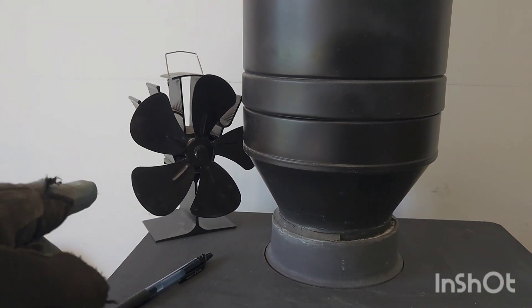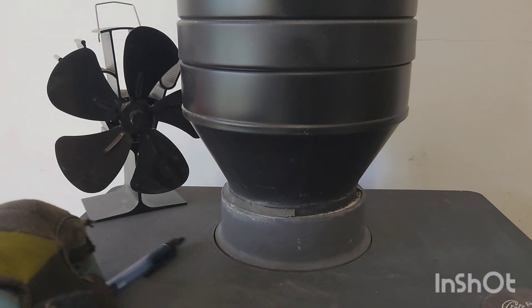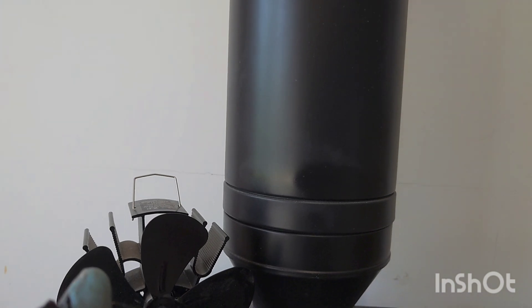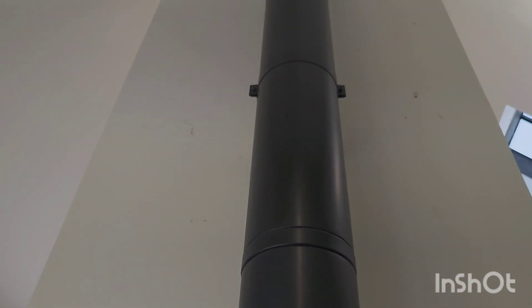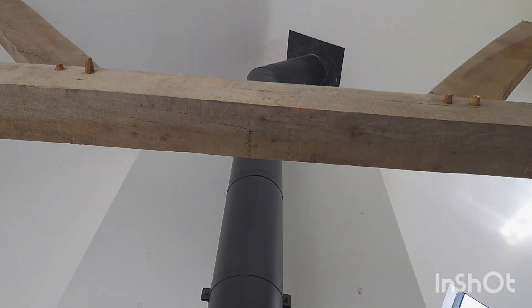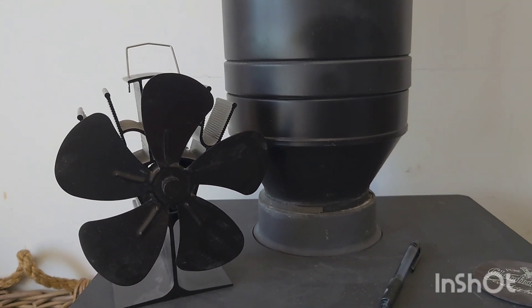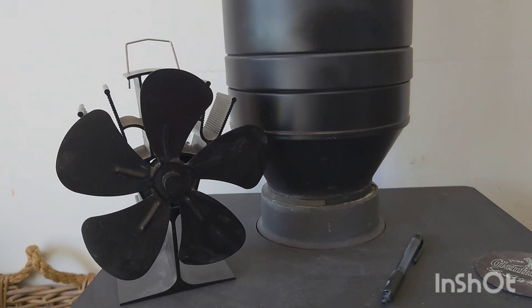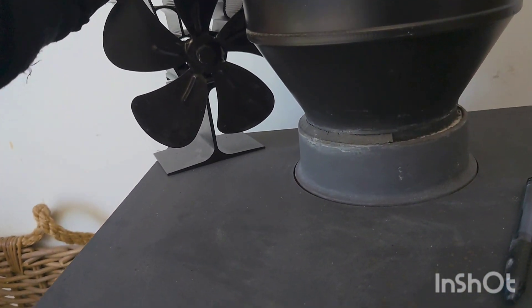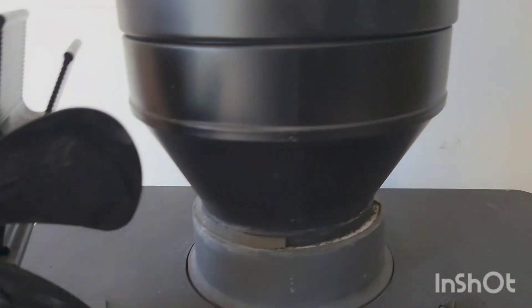This is the appliance I've just done. I've moved the fan and put it at the back. On this one I'm going to leave it as it was — it's the customer's choice. Ideally they should have a single wall flue pipe going all the way up, which would really kick out the heat. They've got a twin wall flue pipe going past the beam, straight out the top around two bends — but it's in really good condition. The customer says it's really hot when on, but with a single wall flue pipe it would be about 30% more heat. With the fan, there's no point having it at the back because you can touch twin wall pipe — it's not going to kick out heat. If it were single wall, you'd put the fan at the back of the actual pipe.